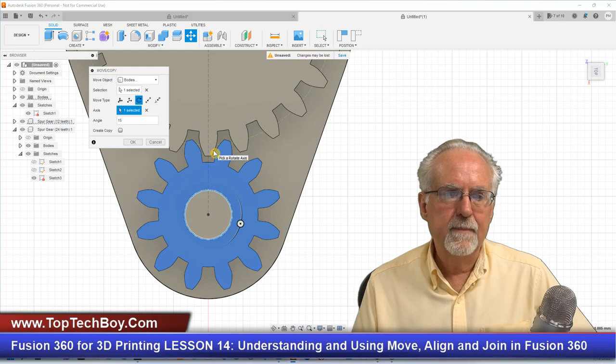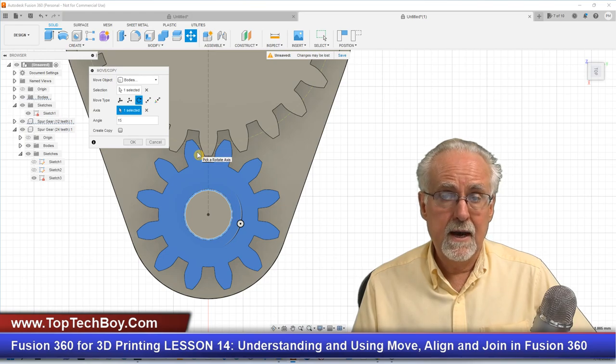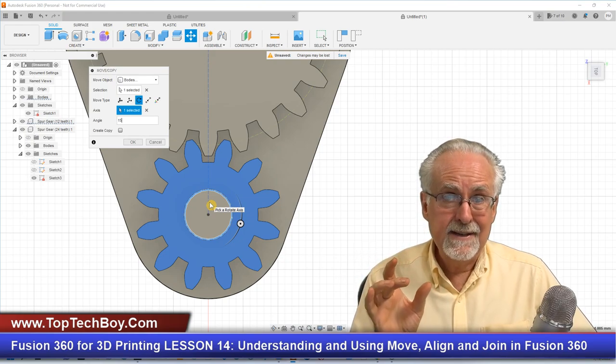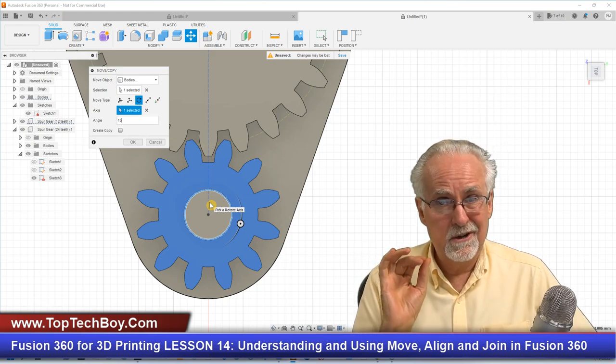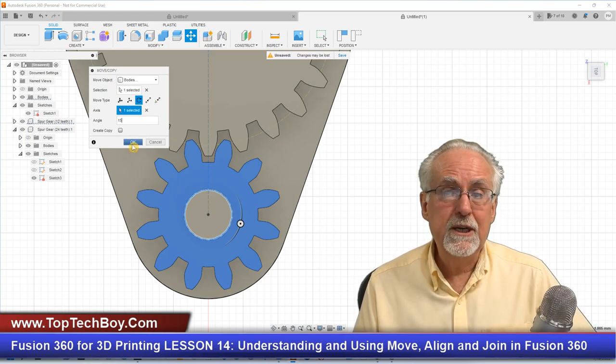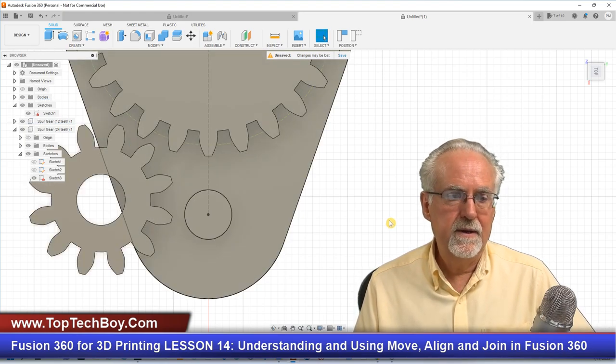You can see the gaps are kind of evenly spaced. Now you see between the tolerance that I used of the backlash that I used and the fact that I scooted these posts apart with 0.2 tolerances, I've added a lot of tolerance where that looks a little bit sloppy, but I like to start a little sloppy when I'm 3D printing, and then we can tighten it up after we've done it one time.